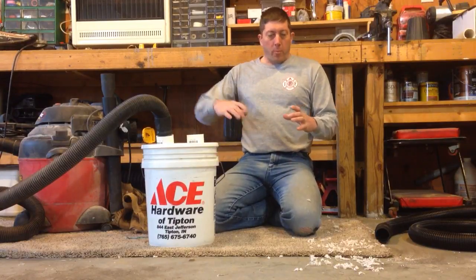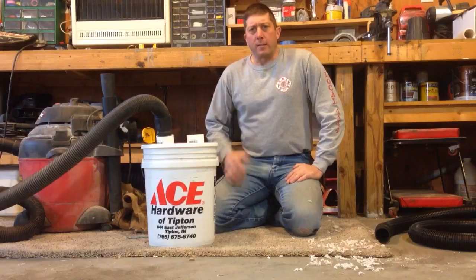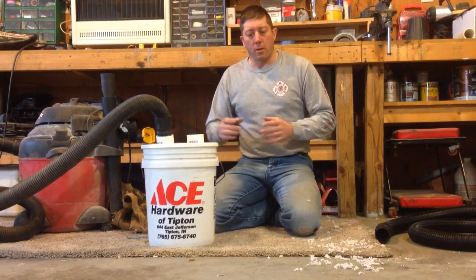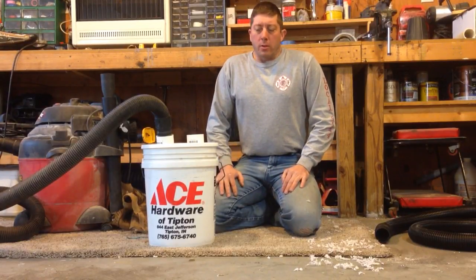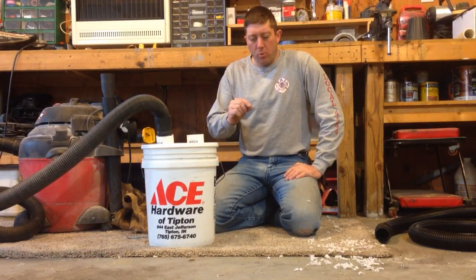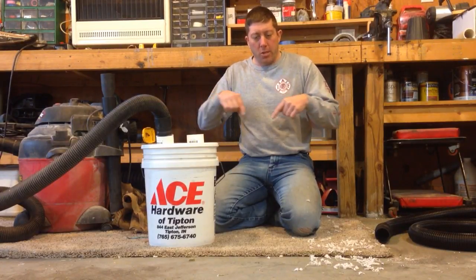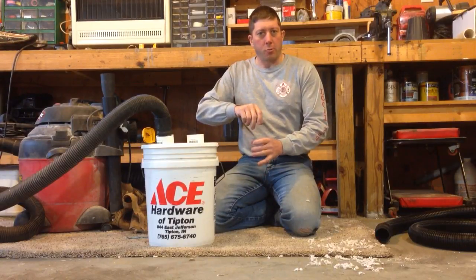The wooden framework on the top to hold the spars and the wooden one on the bottom, the top one broke the first time I used it due to the centrifugal force of a full frame of honey inside the spinner. I took the wooden frame to a welding shop and just had them use 1/4" steel. Copied the exact same layout, but we made it with steel. Drilled a hole through the center, spun it down on the all-thread rod.